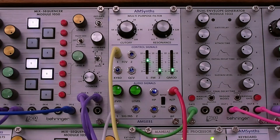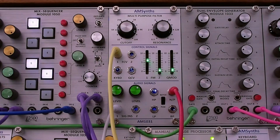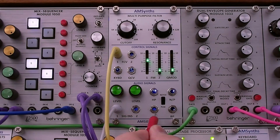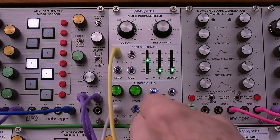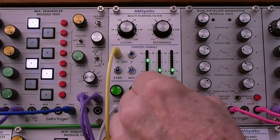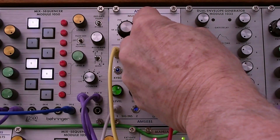This is different from a bandpass filter because the bandpass filter is going to cut off everything below and everything above the pass band. Let's take the resonance down a little bit and go to the bandpass. You notice how the low end disappears as it rises. Now listen to the peak response — we have a constant low end and a constant high end, but wherever the peak is, that's where we're hearing the accentuation of the harmonics.